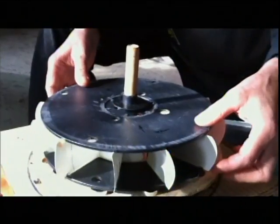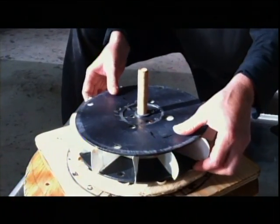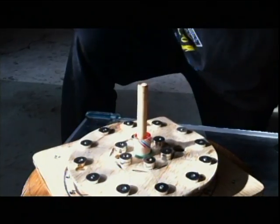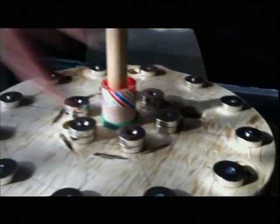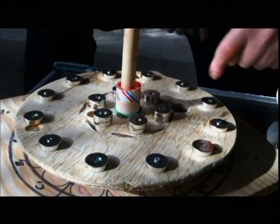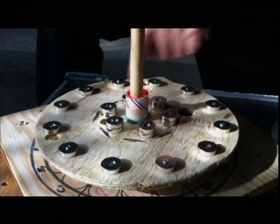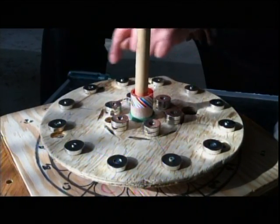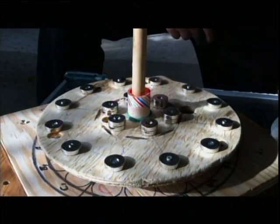You can see this has got 12 fins. I'm going to dismantle it for you because you YouTubers in science and tech never see the inside of these. So I'm going to show you the inside of this. These are the magnets of two three-phase star formations, like in the pedal one. In the center is a single one with all the same poles — it's monopole. These are dipoles. So this will make AC current, but the center ones will make DC current directly without a rectifier.